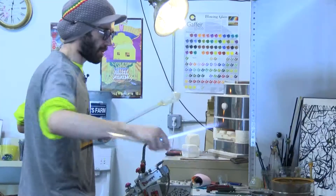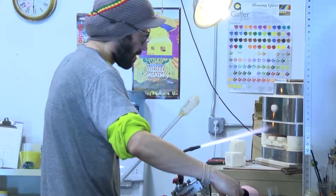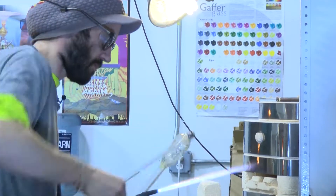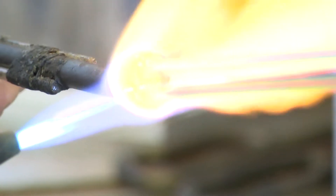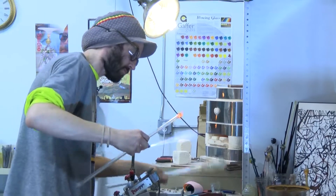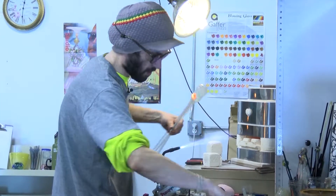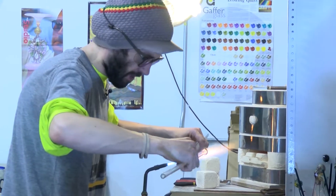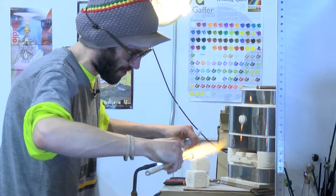I've got kiln dust all over the cup and I've got to wipe that off with my rag. It pulls a little so I've got to open up this guy just a touch more. That's better. Now we're going to go ahead and attach it. This side is already pretty hot; got to get the other side hot for the weld. Whistling glass is always good glass — that's when you know you've got a nice circle.